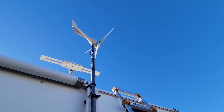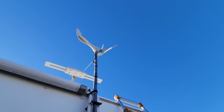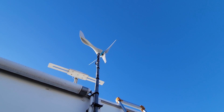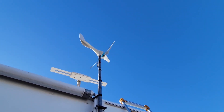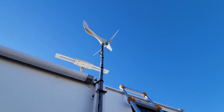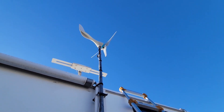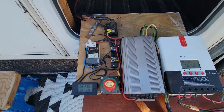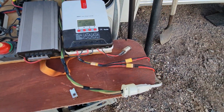You can see it getting quicker and quicker. My original video showed a 400-watt turbine — this is a 600-watt by Sunforce. It does a good job at night, charging the batteries and compensating for power used overnight. The mast is simply 10-foot fence posts from Home Depot with a 6-foot length added at the bottom. That's about it — nothing mysterious.